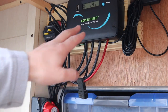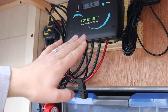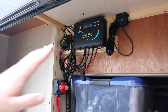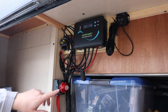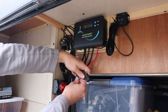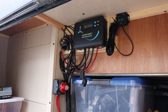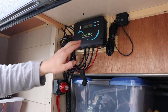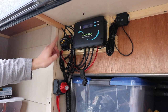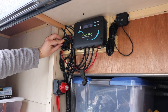First, let's move to the front of the trailer and look at our solar kit. We've got about 16.3 volts coming in, so we're going to disable that voltage from entering the trailer when we install the new battery. We'll take the fuse for our solar panels and pull it out so we don't have any live power coming in off the solar. We can verify — zero volts — and then we'll cut off power with this circuit breaker to the solar kit.